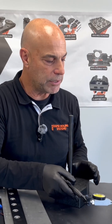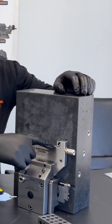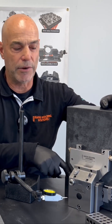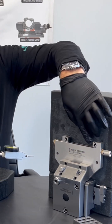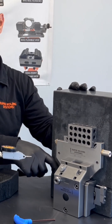Now we would indicate on the presetting stone. First, we would indicate the vise to make sure that it's good at zero zero. We would indicate this face of the vise — that would determine our levelness of our adapter setup to our reference element that's on our wire EDM table. So we would indicate back and forth along this edge. That way we're ensured that we're zero zero, and your part is zero zero to your table and to your reference ruler on your wire EDM.